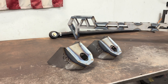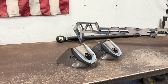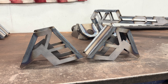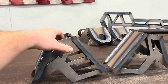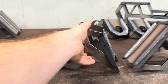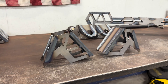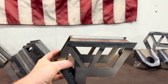Now we'll jump to the bed mounts. The bed mounts — each one is a little bit different. The first three are pretty similar, but there are some differences, so I'll be sure to point those out. This will be the front set of bed mounts. They are a little different than the rest because it actually is left and right — this is the only one that has a left and a right. The side that's going to face the cab, this part is thicker than on the back. Not by much, but it is thicker. The reason for that is on my bed, where my front rail was, the frame was still tapered. So I had to do this to get it so it sat level — if I made them the same size, it was going to sit like this.